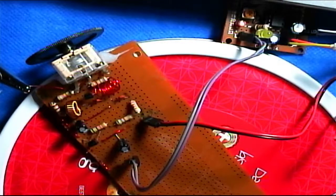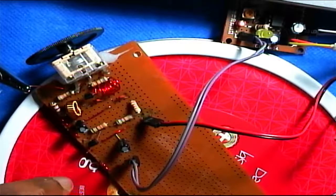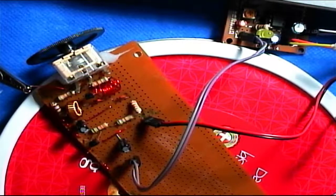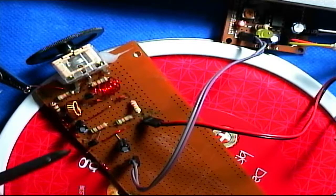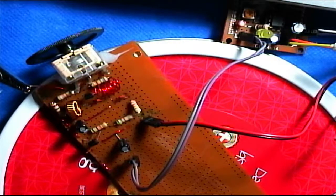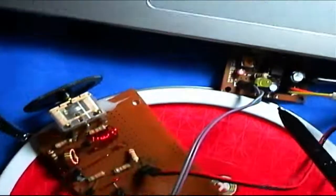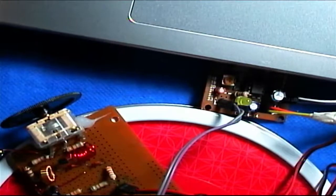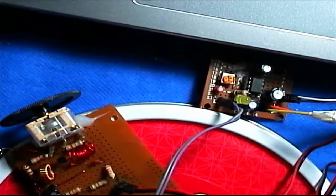Because of that speaker we had to build a pre-amplifier — this transistor here is the pre-amplifier we used to boost the signal going into that amplifier, because we were noticing an impedance mismatch and the signal coming out from the speaker was very low. We built this pre-amplifier to help with last week's demo, but this week we decided to use a LM386 amplifier instead.